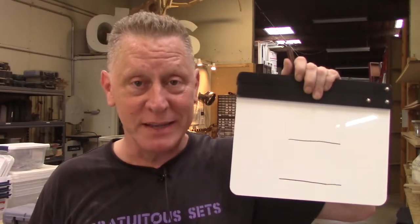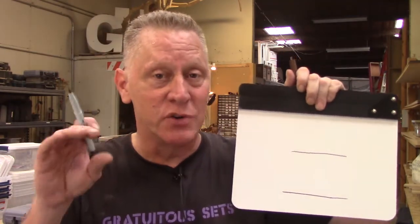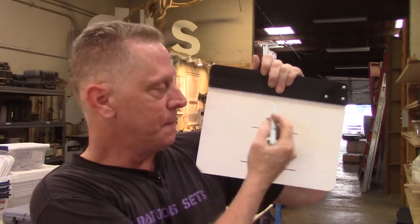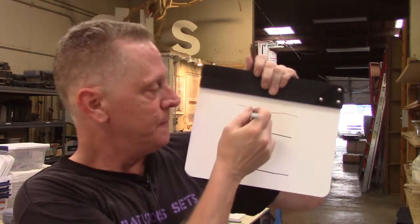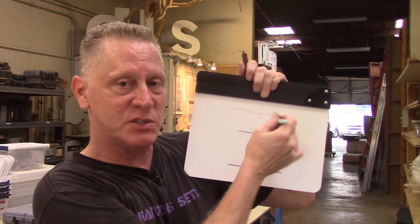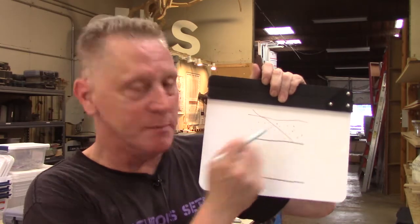Alright, here's the part where I explain to you the thing that you need to know, which is going to really screw the people who clicked off before now. Toner, you need to spray toner lighter than you want it to be. Because here's what happens: this is the surface of your material right here. You spray a layer of toner, and this is obviously magnified many times, and there are lots of pigment particles suspended within that space. The thing is that you can see through those and in between all those particles.